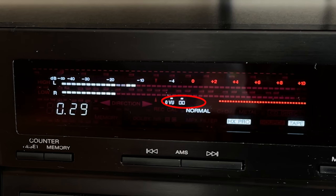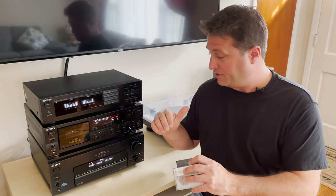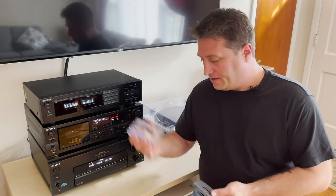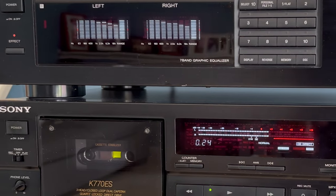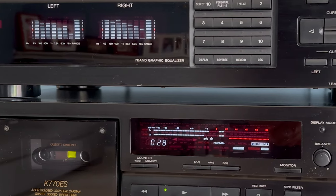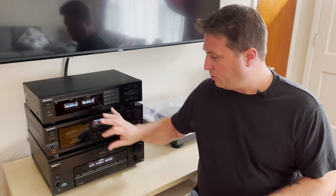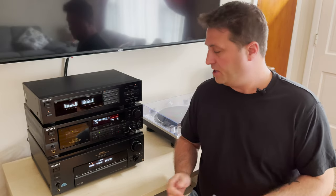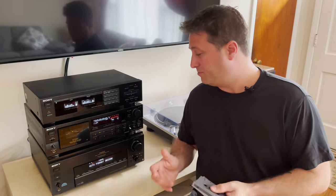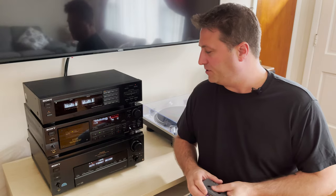The problem I find is that you're recording down at these lower Dolby levels, and I feel that if you had more volume you could keep your main signal higher, therefore increasing the signal-to-noise ratio and getting a way better recording. The pre-recorded Olivia Rodrigo tape didn't sound near as good as when I did a digital version on this tape and maxed out the recording level. Over time we also got way better electronics, way better recording equipment, and additions like HX Pro — that's really the sweet spot for tape.